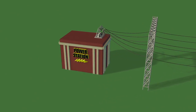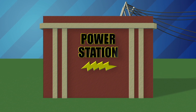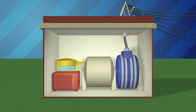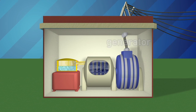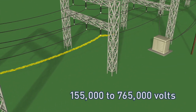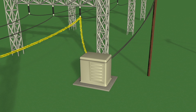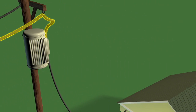To understand how RAPS works, first let's see how electricity gets to your house. Most power plants burn a fuel, like coal or natural gas, to heat water and produce steam. The steam spins a turbine, then a generator changes that mechanical spinning energy into electricity, which is carried in high voltage transmission lines long distances to your neighborhood substation. There, transformers lower the voltage, and then distribution lines carry the electricity to the pole outside your house.